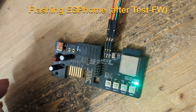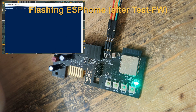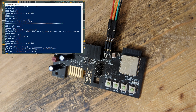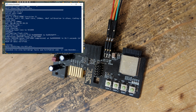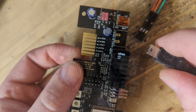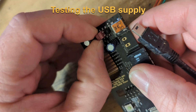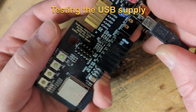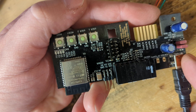If we are now connected to power, we usually see the test program running. And if you order the ESPHome one, I'll flash the ESPHome firmware. The green LED flashing slowly indicates that it has no connection to Wi-Fi. We also test the USB power connection by setting the jumper in the right place, and as soon as we connect, the ESP should start with ESPHome firmware. And it works.